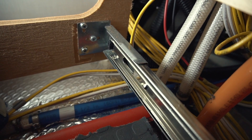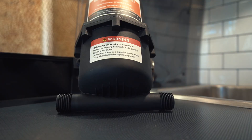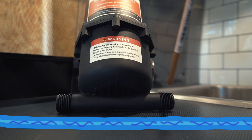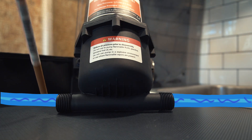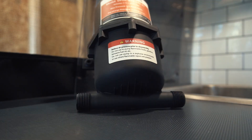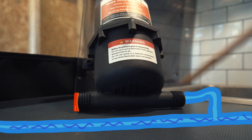I can also tie into the PEX lines here on the floor. The tank can be installed in a few different ways: it can sit in line — you could cut the water line and replace that portion with the tank — or you could cap off one end of the tank and tee into an existing water line on the other side. It doesn't really matter which side, as long as the tank sits downstream of the water pump and is somehow connected to the water line.